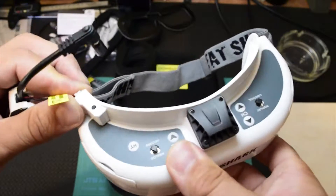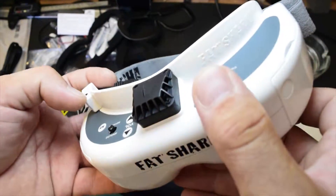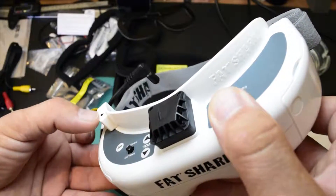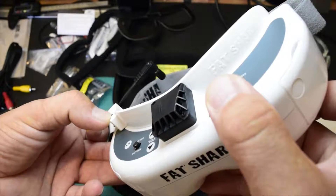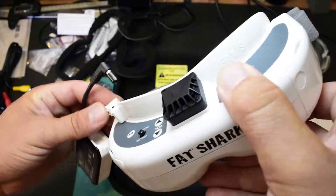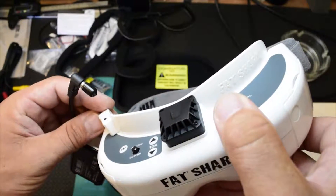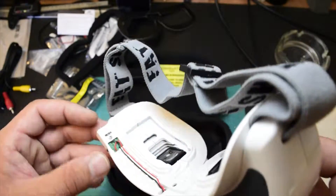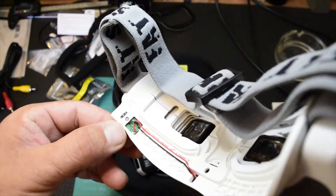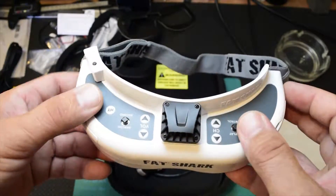Let's test the fan. The camera can't pick it up, but yes — pressing it once starts it and it's working. Pressing again doesn't stop it. Long press doesn't stop it either. If you unplug the balance charger, it stops. If you plug it back in, it starts again. So whatever you do, this piece has something inside memorizing the 8-minute timer until it stops by itself. If you want to stop it before 8 minutes, you have to unplug the balance charger.